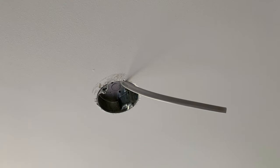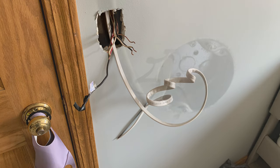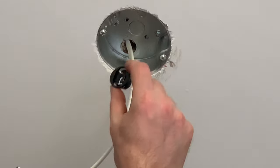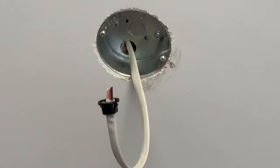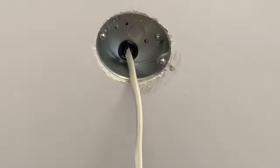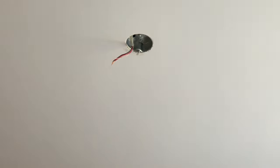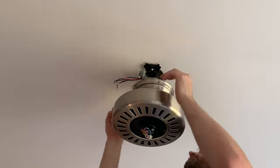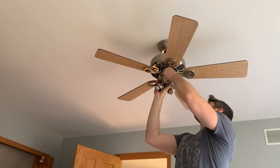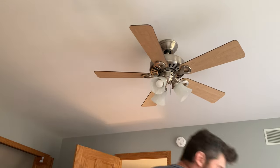Here is what I have below — I have plenty of wire to work with hanging out of the fan box and the switch location. Next, I mounted and wired the ceiling fan. I tightened the two box screws to secure it to the brace, then prepared the new wire by installing the cord grip — slide it up the wire and seat it into the knockout in the fan box. Then I cut the wire to length and stripped the ends. Use the installation manual for your specific fan and assemble it accordingly. Mine was pretty simple and straightforward, but it took some time. Assembling the blades definitely took the most time. And there it is — looks like a ceiling fan.